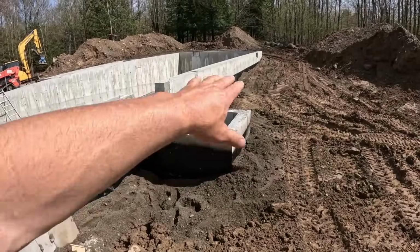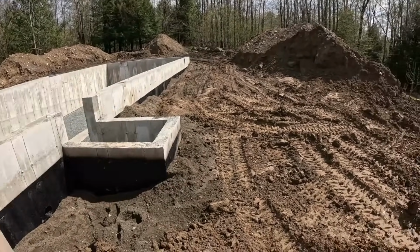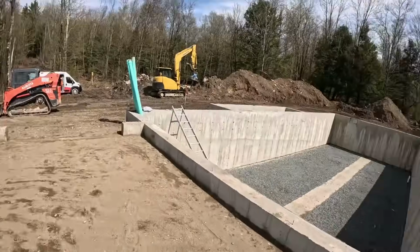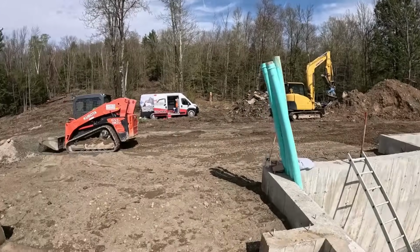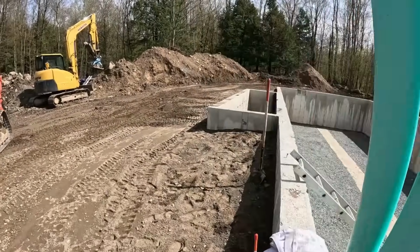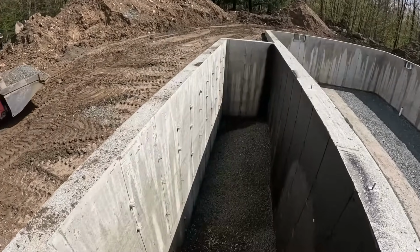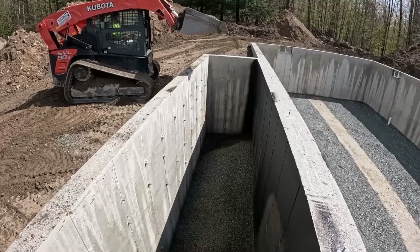And then the rest of this up to the tar will get chucked up with the existing soils to pitch off when time be. This is gonna dry out, but at least we got this all compacted and everything around this long house, 96 feet with the overdigs. So we'll fill this right on up and then hit it with the compactor as she comes on up.